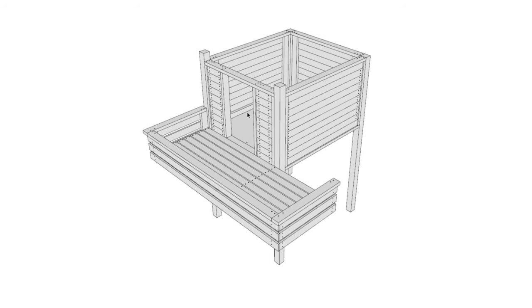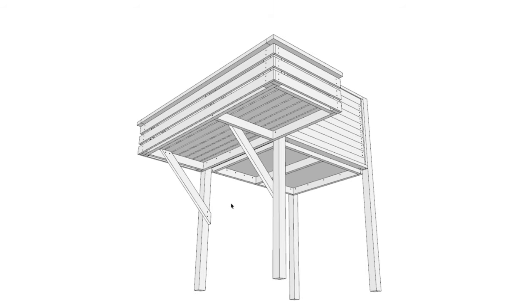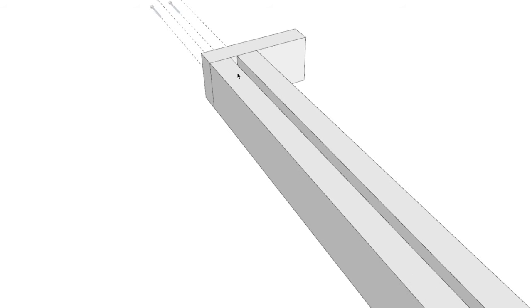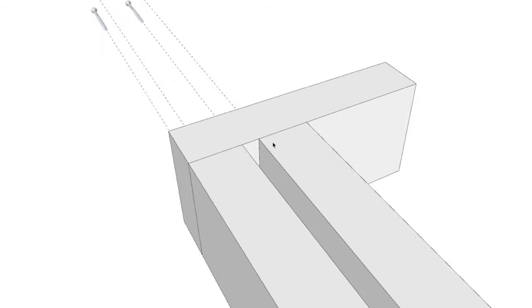By the end of step four you should have a beautiful doghouse with a reinforced patio. Now we're moving on to step five: adding the stairs. Begin with the initial stair made from 2x4 lumber — two pieces at 7.5 inches long and two at 26.5 inches long. Secure with wood glue and 3.5-inch screws. The 26.5-inch pieces need to be half an inch apart — you'll see why that's important in just a moment.